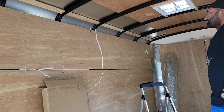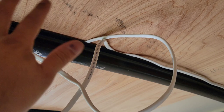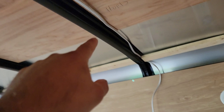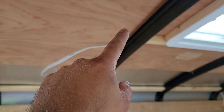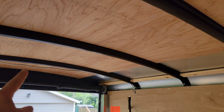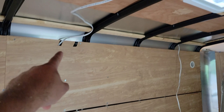Using 14-2 just for the lights, I ran it there, there, and over here to the first can light — it can be a can light, surface mount, or any type you want. From there we go back the other way to another can light, then down and up to a third can, then down and up to a fourth can light at the end. Four can lights total. This wire comes from the switch on the hood area all the way up.